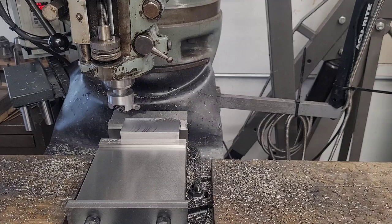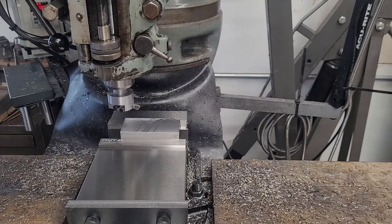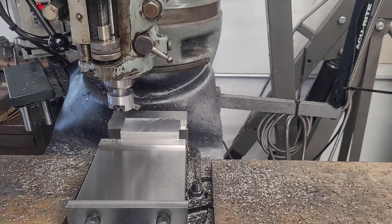For those of you using benchtop mills — which would practically fit on my work surface — these are great tools, because even using a half-inch end mill on those is about the absolute limit of what they can handle; sometimes even three-eighths or a quarter inch. You also often don't have the same RPM. This machine is limited to 2,720 RPM assuming 60 Hz electricity. I've talked to some people who have benchtop hobby machines limited to like 1,800 RPM. If you're that RPM-limited you can't spin the tools quick enough to get a good surface finish, especially with carbide.